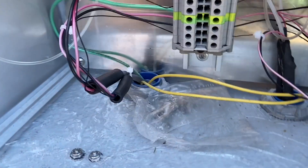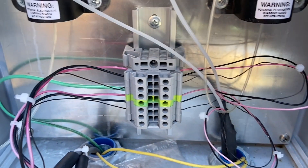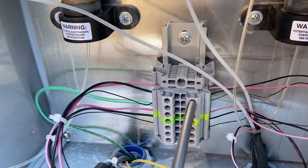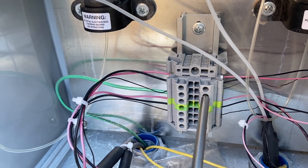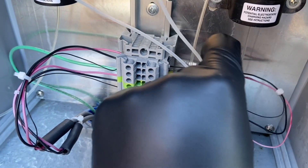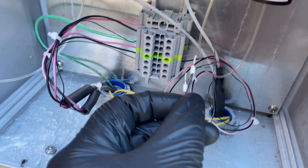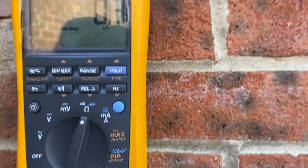The left side is where the cables come in from the PLC cabinet, and the right side goes down to the wet well. We'll go ahead and disconnect the right side, because that's the actual end of the transmitter cable. This will let us narrow everything down and make sure it's not an issue with the wiring from here to the PLC cabinet. Those little accordion-looking things are called bellows — they hook to the vent tubes of the transmitters to keep water from getting in them. Those vent tubes are there so the transmitters can adjust based on atmospheric pressure.